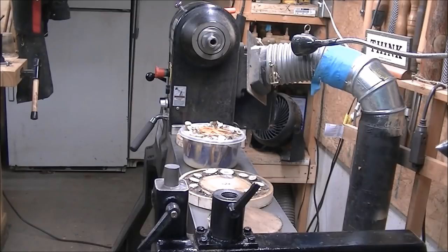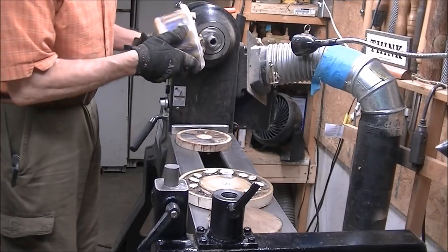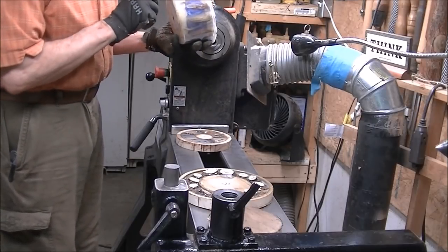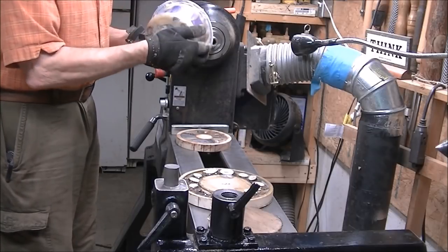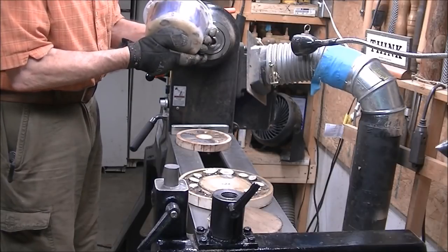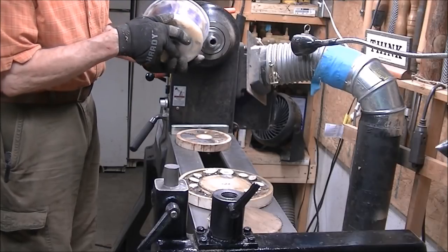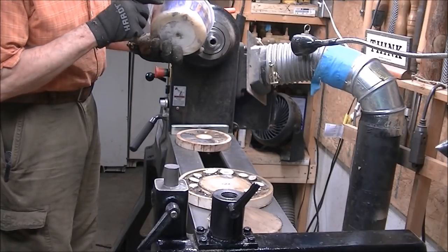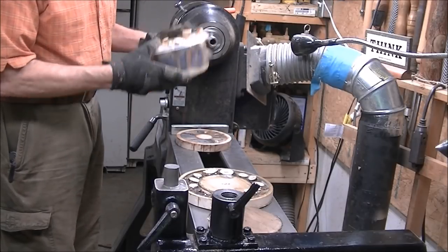All right, I've got everything out of the pressure pot now, and all three pieces are poured up. They actually turn out quite well. The only flaw I see is where I accidentally used Alumilite here in the bottom, which does not like moisture at all, and evidently there was some in there. So it sort of looks like it's sitting in a bed of froth, which I guess will be all right. But there are no bubbles or voids in the other two colors. They look real good. I'll really know when I get this off.